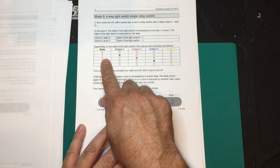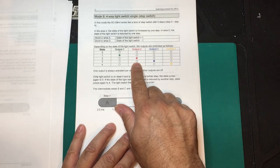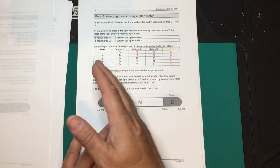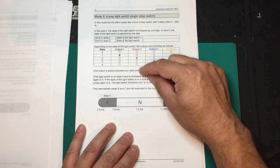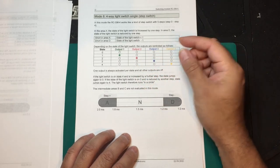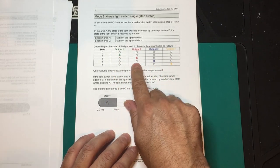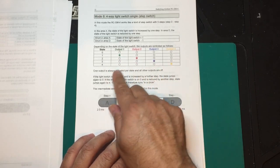Bearing in mind, as you switch on one output, output 1 goes off and output 2 comes on. So if you had 4 sets of running lights, which you wouldn't typically use at the same time, but you want to be able to choose which ones you have, and say this output could run out to a small flasher unit that runs, say, a beacon. So you could have front beacon, rear beacon, side beacon, and maybe somewhere else. But bearing in mind, that comes off, that goes off. On, off, on, off, on, off. So you have 4 outputs.